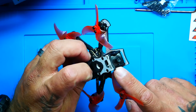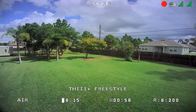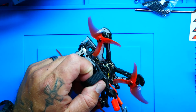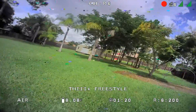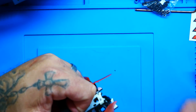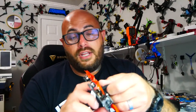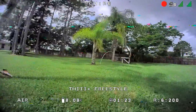On board you'll see a small but powerful HD Zero camera up front. It wires up to the HD board in the center — that's your VTX handling all video and communicating to the goggles, sending a live video feed. Underneath is the AIO: ESC, flight controller, and ELRS receiver all built into one. That board has plenty of power to run the upgraded 12025 7000KV motors, which spin the traditional 2.5-inch AVAN props. The props are sturdy — I still have more extras than came in the kit and I've taken some hits.